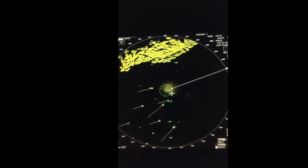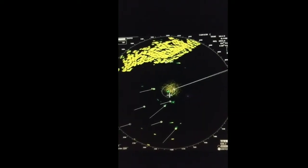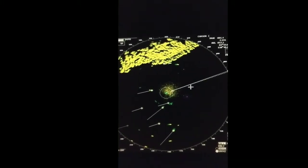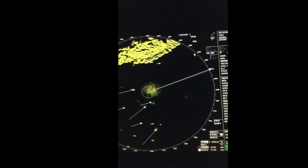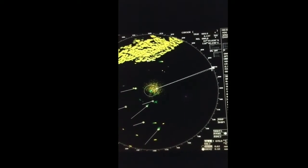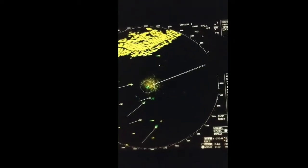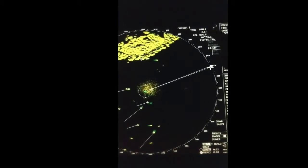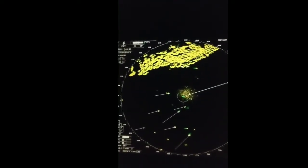You can see the dotted points and one line making a circular rotation — that is the indication of the scanner. From the middle to the end of the PPI is about six miles. So six-mile range means the PPI will show up to six miles.